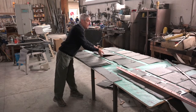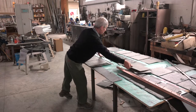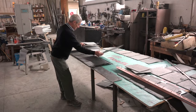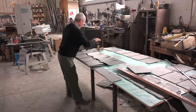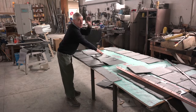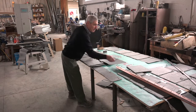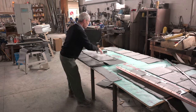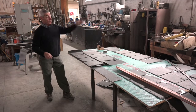From there, you can either use a mansion slate single, or if you're using our slate shield — which is the panel and the slate separate — take your panel, that goes down right here, and then nail that up here with your nail gun nails. Then your slate will sit in here like this, and your next panel will then fit right into here. This slate will go on, again nailing with your nail gun right up to your ridge.